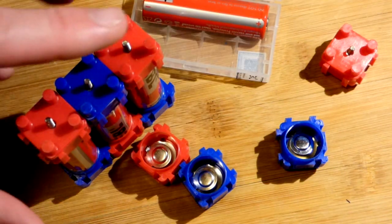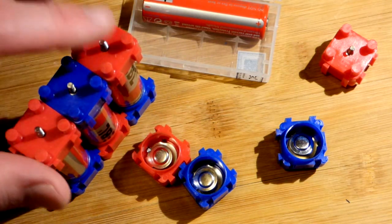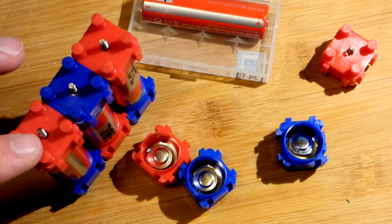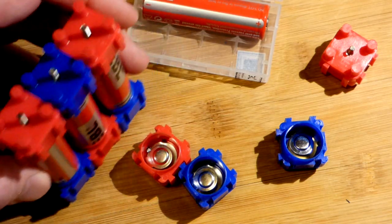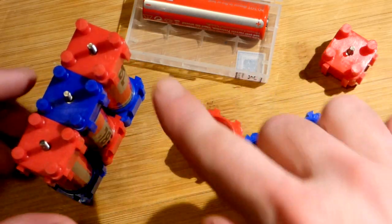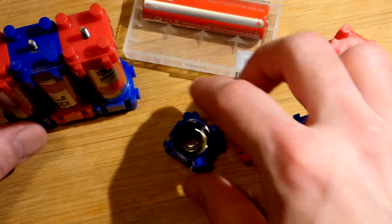Now that we have the batteries ready to be wired in series — positive to negative, negative to positive — you put one bus bar across there and then one down there, and keep going down the line if you want more in series. This is now three in series. We're going to make a three-series two-parallel configuration.